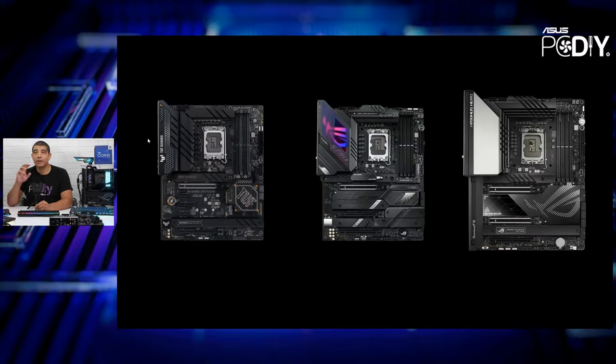They all feature high performance teamed power stages on all of the motherboards, so the power delivery quality is going to be great, stable and reliable, whether stock or overclocked. But the Maximus will feature the highest performance power stages, the greatest number of power stages, 10K rated capacitors, and microfine alloy inductors. The differential DiSense voltage monitoring is also exclusive to Maximus here.